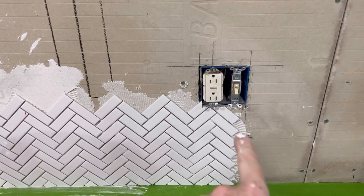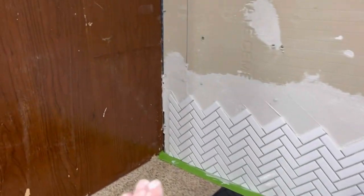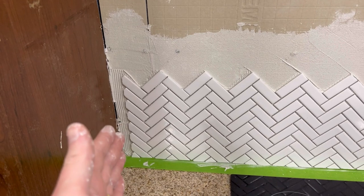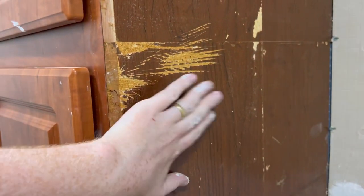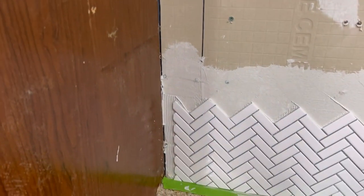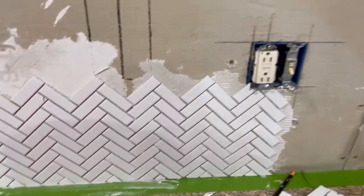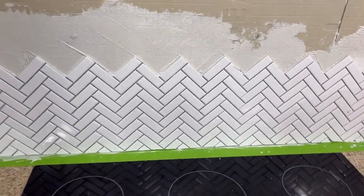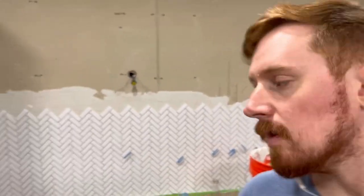I flattened out the areas — I'm using a 3/16 trowel because that's what was suggested. I've got to make another cut for this outlet here. My edges are looking good. I'm going to have a piece of wood — this is a little short — but I can use one tile instead of two on each row. I'm going to have a piece of blocking going up here because I'm putting a piece of wood on this as well, so you'll never know that happened. I'm not even using spacers where these are separating right now, but it looks good guys.